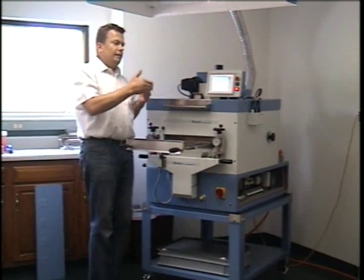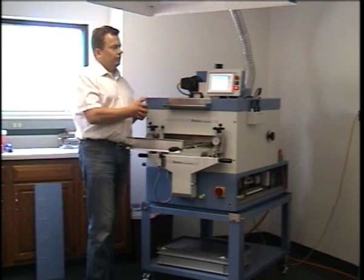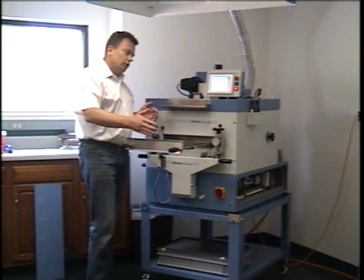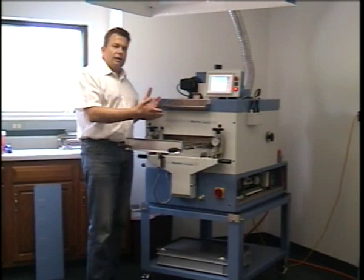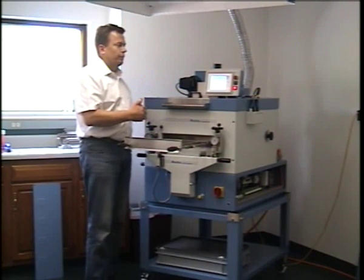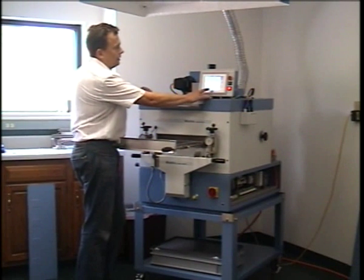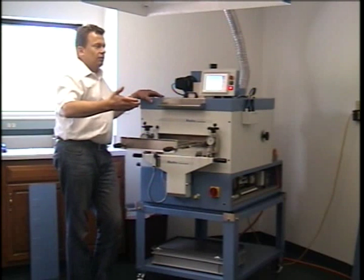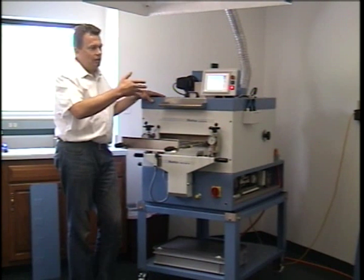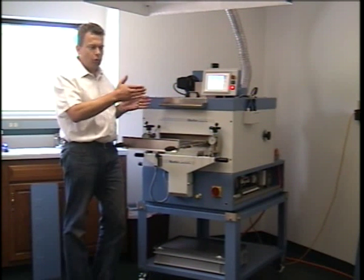What that will do is wait for that trigger temperature to be reached before it starts the dwell time. As an example, if we have a 30-second dwell time and the coating is wet, the frame will go in and start to dry, but the dwell time will not start until, say, 100 degrees is reached, and then it will start counting down. And we have the third option, mode B. So in mode A, with the example given before, the total time displayed may be 1.5 minutes, but your dwell time at the trigger temperature was only 30 seconds.